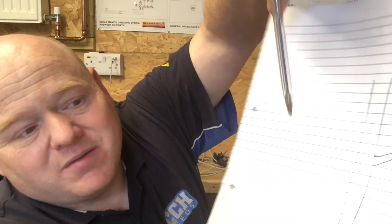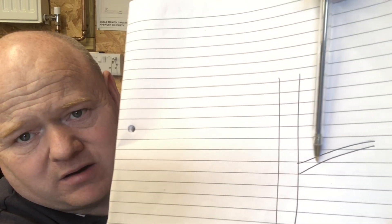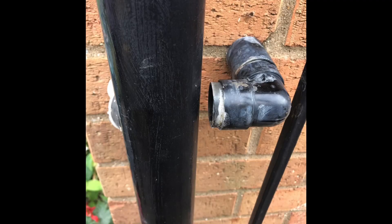So that's your Worcester Bosch boiler. What's happened is the boiler has filled up with rainwater after a heavy downpour. The condensate pipe is not connected correctly — it's been connected into the rainwater pipe. Somebody's teed in, cut a hole with a hole saw, connected it in and sealed it with sealant. The rainwater pipe is connected to a soakaway, and with heavy rain it's backed up into the boiler and flooded it. This is why it's really important to read the installation instructions.